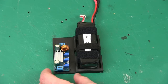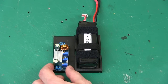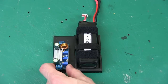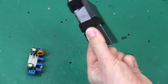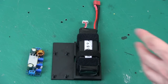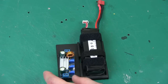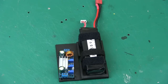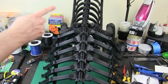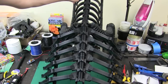I've printed this little mount here which holds a voltage regulator — a five amp regulator — which will power the Arduino Nano in the hand controller and all the NeoPixels on the suit. I've also got the battery mounted on here with a piece of Velcro. That's an 11.1 volt LiPo, which is about 12 volts typically. That will give me five volts for the NeoPixels, and the 12 volts will go straight to the head where there's another one of these that powers all the servos. That voltage regulator and battery mount are going to fit into the torso, where the other half of the connectors will come out to the shoulders for the arms and up to the head.